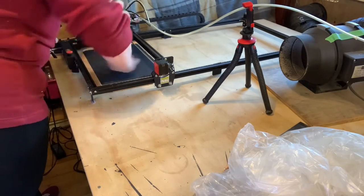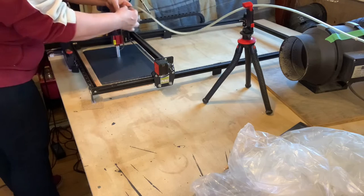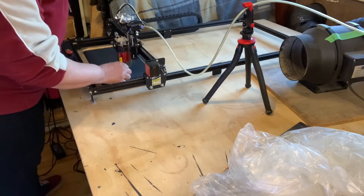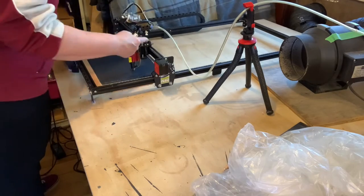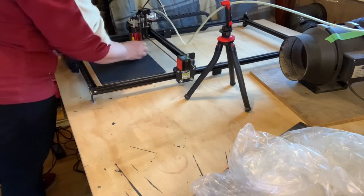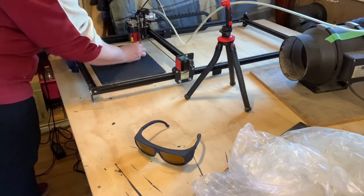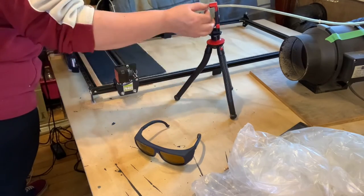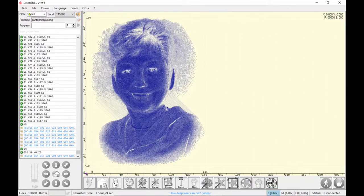I'm getting my slate nice and square into my machine and focusing. You'll see me clean off the nozzle — I had been doing some wood laser engraving and didn't check my nozzle first. Make sure that air assist nozzle is clear. I'm using my measurement focusing tool in quite a number of spots and I'm realizing my table has a slight bow to it, so it's not equal throughout. I'm going to put some little foam anti-slip grip pads under it to bring it up enough that everything is level, and I give the machine a workout while it's turned off to make sure everything's moving smoothly.